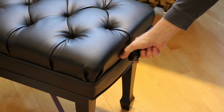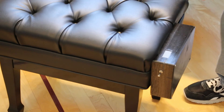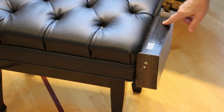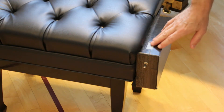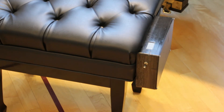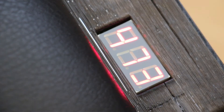Here's the knob — you have to turn this thing and it's really hard to turn. Over on this side, I've replaced the knob and put in this device here. It has a motor hooked up to it and a computer control device that tells you exactly how high the bench is. You can set the height you want it to go to. This is the up and down switch — if you flick it on for a moment, it tells you how high it is.